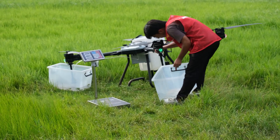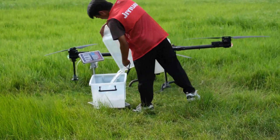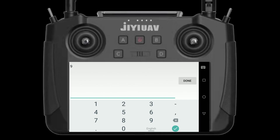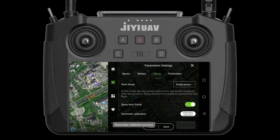Step 5. Measure the water that goes into the two containers. Don't forget to subtract the weight of the two containers themselves. Import the volume of the water on channel 1. Click OK and then you get the flow meter calibration done.